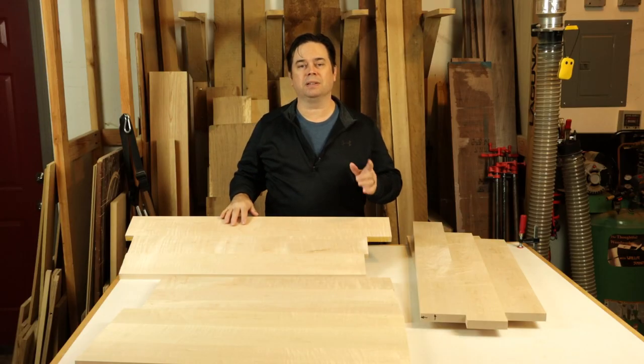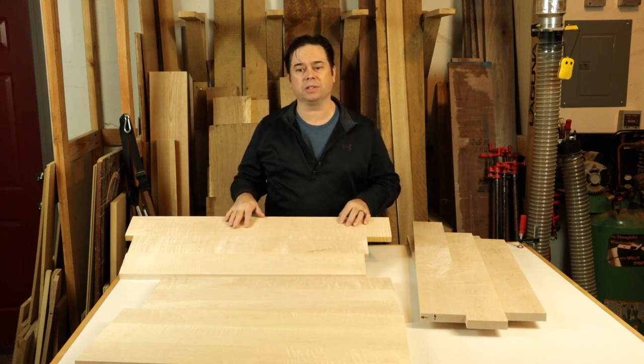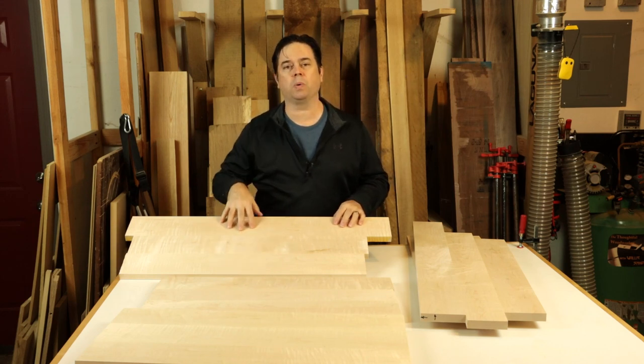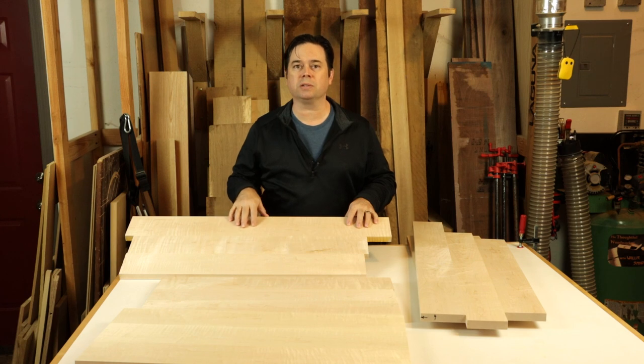With the width of these panels, it's a little bit of a challenge. Unless you have a 25-inch planer, you'll have to break those down and do it in two sections. So what we've done here is worked up 12 or 13-inch wide panels. After the glue-up, we just went ahead and planed those down to a finished dimension. Then the final step, we'll be gluing those pairs of panels together to get our final panel size.